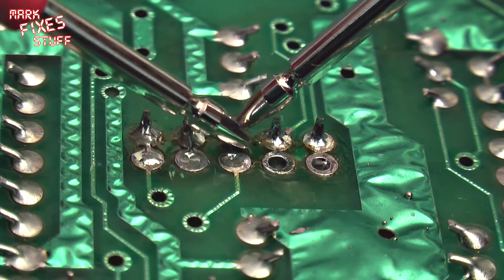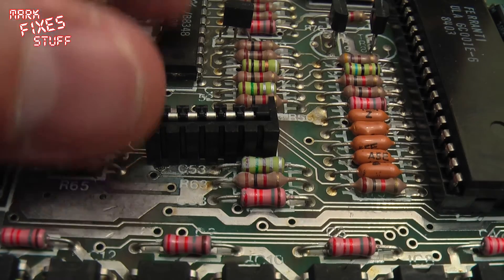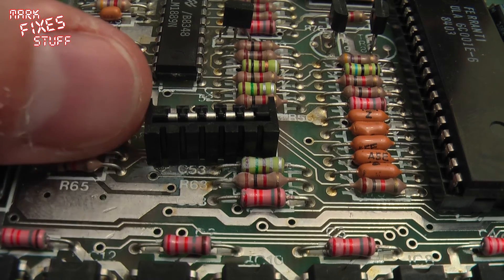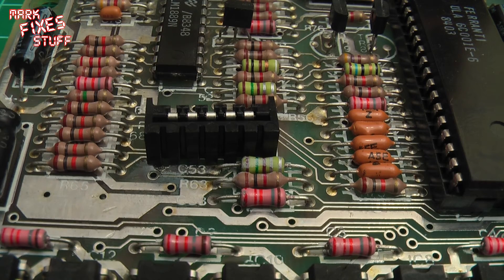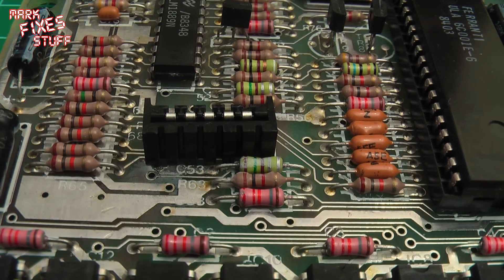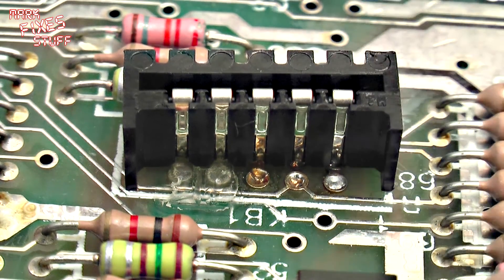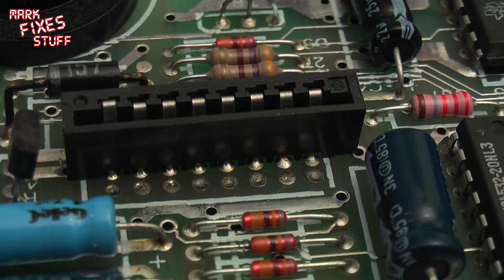It's all good. Here we are with the replaced socket — now there's a slight angle to it, I'm not going to lie, but it was better than having to go through the glue behind it. All checks out continuity-wise — I've checked all the points to all these pins, and good continuity, not too much mucking about. And that is basically it — that will be ready now for your new membrane. As you can see around the back, everything looks fairly tidy. Keyboard 2 is exactly the same process, except there are more legs. This is Mark from MarkFixesStuff, signing out and telling you to subscribe to get your fix. I'll see you all again in the next exciting episode.